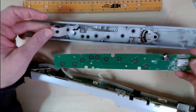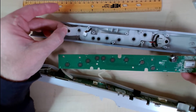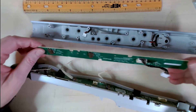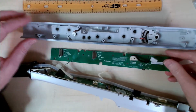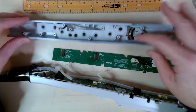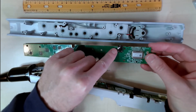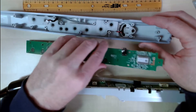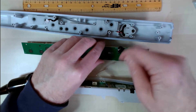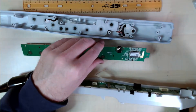This is just a membrane switch, and it's got a little conductive rubber on there that closes the contact on each of these. And then this speaker connection goes to the speaker over here, and the audio jack is connected here. When you push this in, there's a switch that connects so it can disconnect the speaker audio when you plug that in.